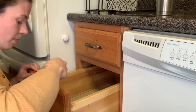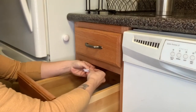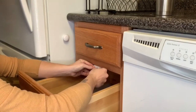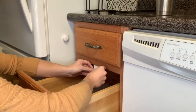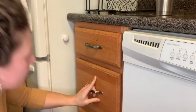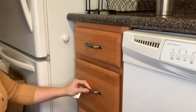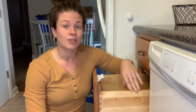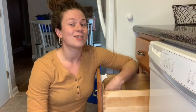You do your swab. Your strike plate with the nose facing out. Your cradle, flat face facing out. Your lock, latch pointing up and in. Close the door, press and hold everything, and you're good to go. Sometimes with cabinet drawers, the drawer body height interferes with where the lock needs to go — and we'll talk about that when we get to the troubleshooting.